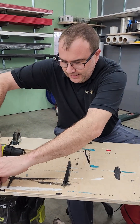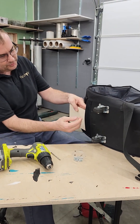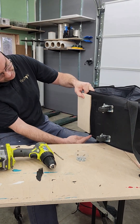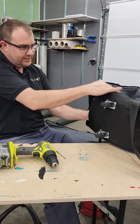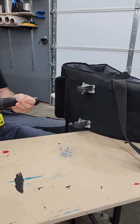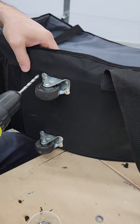The first thing we have to do is drill out these rivets. To do that safely, we take the board that we have prepared and slide it in to protect the back side of the case in the event that the drill bit goes all the way through. The board is actually sized longer than the opening, so it'll have to go in this way, and then once it's inside, you'll tip it up into place. Once in place, make sure that the board is somewhere behind this caster as we drill these rivets out.